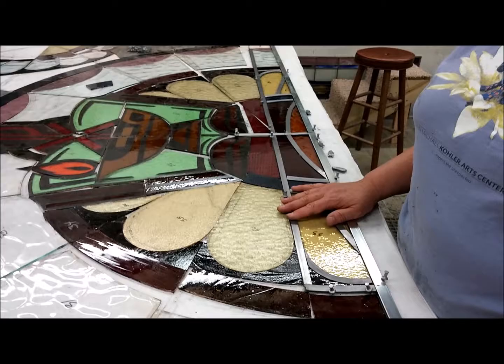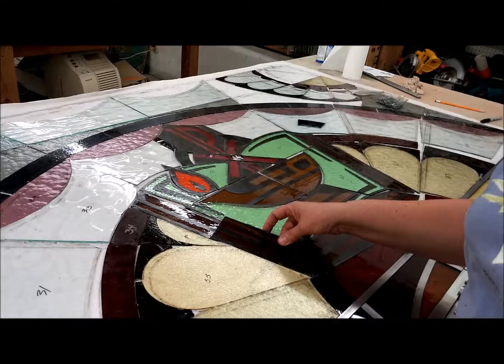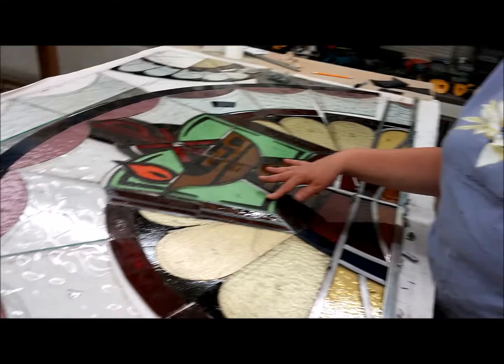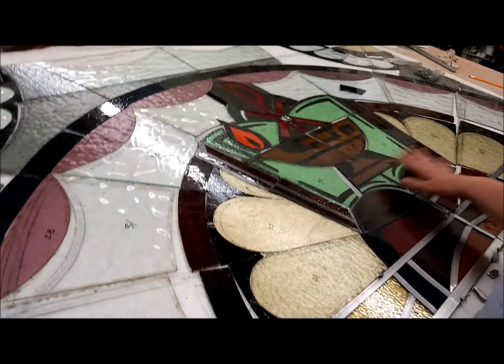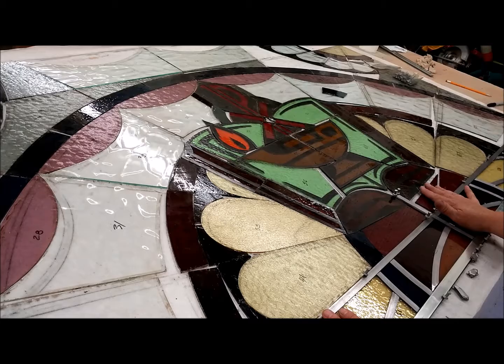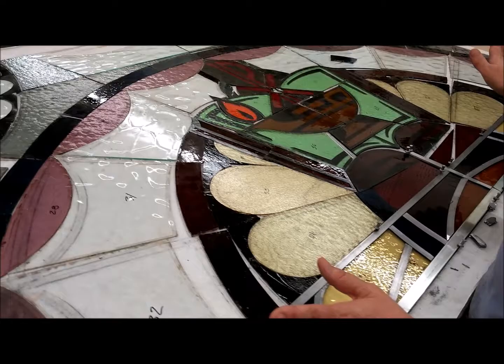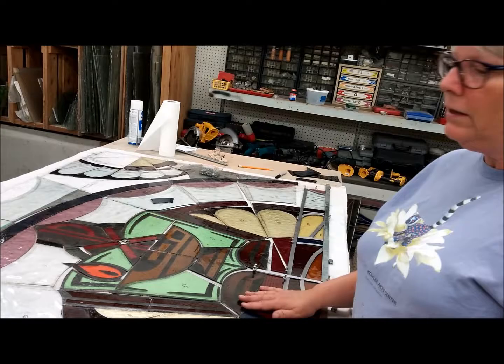The zinc construction runs through here — it was all beautiful half-inch old-style. The painted pieces actually framed it out with paint, so when you look at stained glass in the window with light transmitted through, you see just a silhouette. These will look just like the lead area from where people are sitting — a silhouette where the black paint fused on the surface completely masks it. We match color, clean up, paint, and then construct. It's still all done by hand — nothing has changed over centuries.